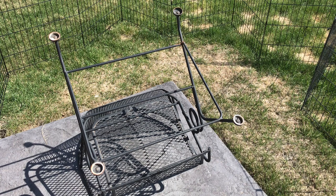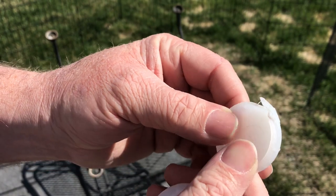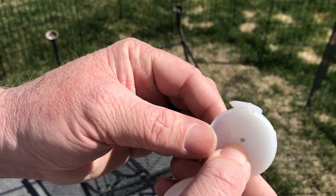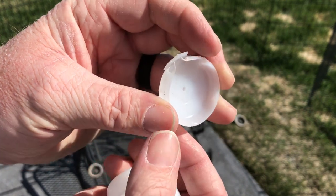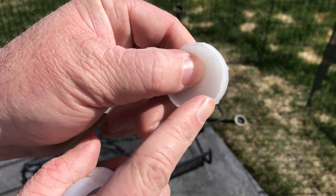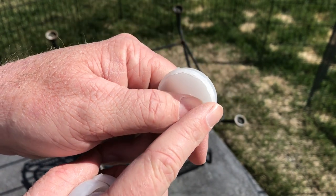As a professional homeowner, I'm keenly aware that things rarely go the way you envision them. In this case, if you do not hit the cup exactly in the center to get it started, there isn't enough taper on these and they'll go crooked. Your next hit with the mallet will make it go sideways and put a good gouge in the side of the cup, and we can't have that. So what I did is I went into the shop and put a little bit more of a taper on them with the disc sander. Let's see if this will provide a better fit.